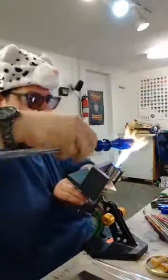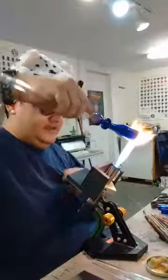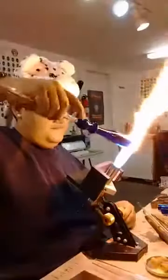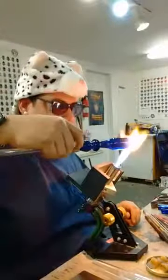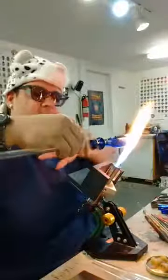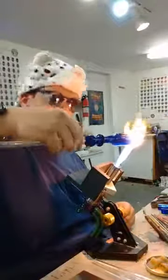So now you see where we're at. We've got kind of a dome shape on the end of this thing, and the wall weight is pretty good and even. So now what I'm going to do is blast the crap out of this cap that I've created, and actually need to make it a little bit more oblong. But I want this thing to be smoking white hot. And then as I get it white hot and to where I want it to be, I'm going to blow it out, and I'm going to blow it out super thin. And it'll be kind of like a light bulb shape.